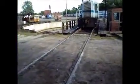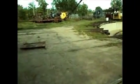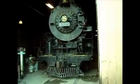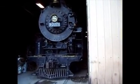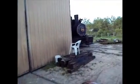We also found a leaky stay bolt, unfortunately, but what we think happened is the boilermakers might have grabbed the wrong stay bolt and put it in. That might have been cracked or in the telltale. That was one we needed to have replaced. So they'll bring it out again tomorrow, and they'll torch it out and put a new one in. Anyway, I want to show you on the side here.